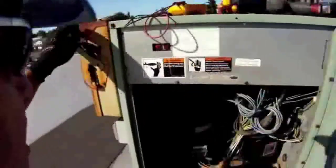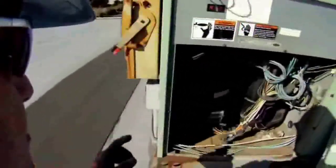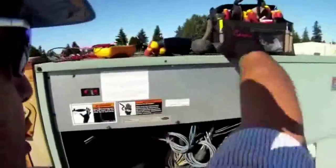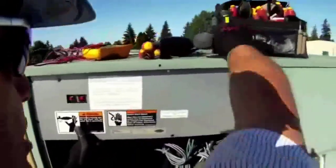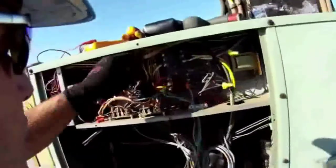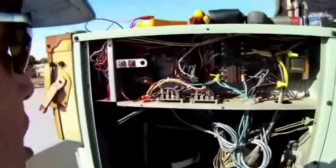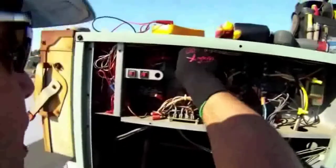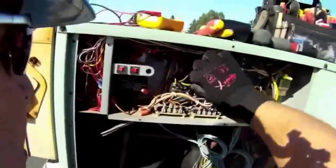I have two compressors right here. I've got an electrical cabinet here. We're going to de-energize our system and open up the electrical cabinet and just take a look in there. Anytime I open up a piece of equipment, I like to take a look at the electrical. These units sit up on a roof and are used a lot, so I like to go through and check all my wiring. I'm looking for brittle wiring and burn marks on the wiring or on the contactors. I've looked at those last month and I'm pretty content that this unit is in pretty good shape electrically. All the connections are nice and tight — nothing that's going to vibrate off.